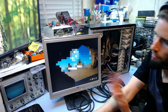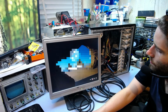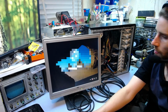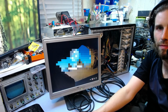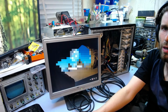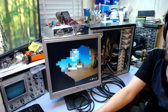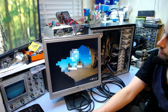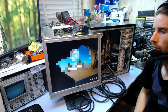Well, I was not going to log in and show you this computer here, but suffice to say, obviously the power supply works again. Computer's running, so there we go. That was it. Blown 5-volt standby controller and resistor for it. It was the TNY277, and its fusible resistor blew out and took the whole supply down. But easy fix, just 2 components.